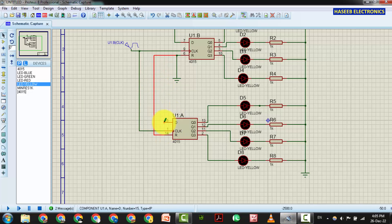To activate the second stage, we need to connect pin number 15 to pin number 10. When pin number 10 goes high, the next clock pulse — because this section is also receiving the clock pulse but will not work since data is low — at each clock pulse the output will be low. But now we connect pin 15 to pin 10, so when the last LED turns on it will have logic high, enabling this section. That high signal reaches data input pin 15, so this IC will also start writing high signal at the output.